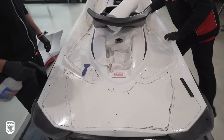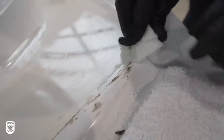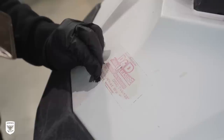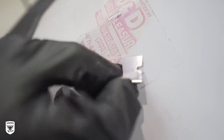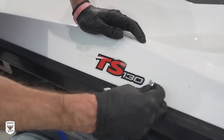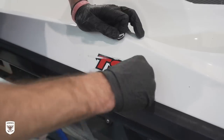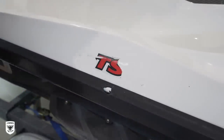After the pads were removed, the remaining glue needed to be dissolved with Goof Off glue remover and a plastic scraper. We also removed the dealership stickers — they were fading and messed up, they had to come off. Same concept as with cars: you always tell the dealer to leave the promotional stickers off before you buy if possible. The owner also asked for the badges and registration to be removed for proper replacement later, after the gel coat restoration.